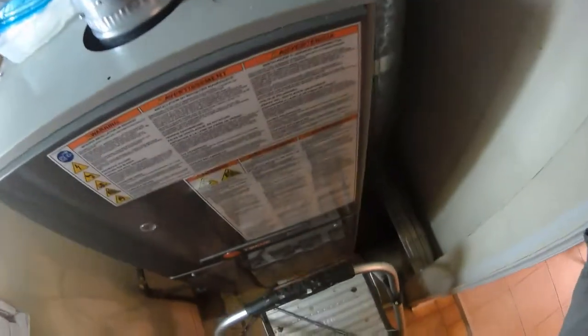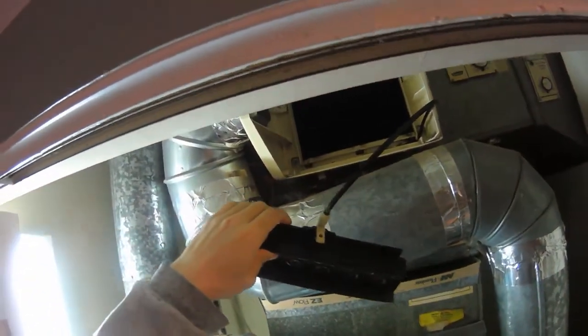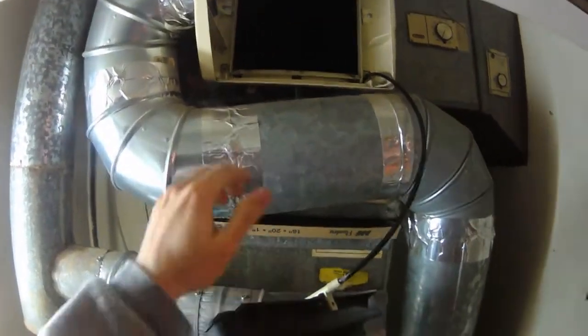So this is new, and this is fine. And the issue is this line — right there, it broke. You can see, so when the water supply comes in, it just dumps out of here and then drips out the bottom. Ideally it'll all be connected and come out the top, and then diffuse throughout the evaporator panel, but that's not happening with mine. So we have to replace the line.